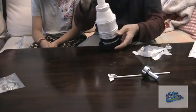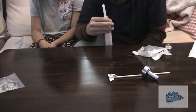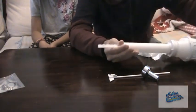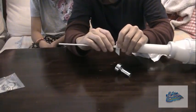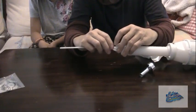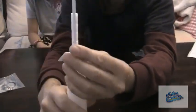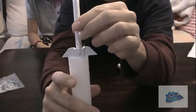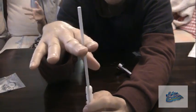Okay, so inside the tube now, you'll see sticking up is our threaded piece here, and into that we'll slide this piece here, this way up. That goes down all the way into here. Make sure you can see that. So that slots on like that, and then this now will be poking up through the top of your cistern. You put the cistern lid on top of there. That's poking up through the cistern lid.